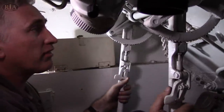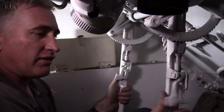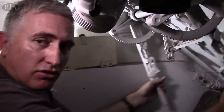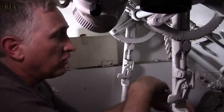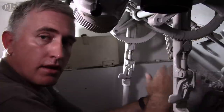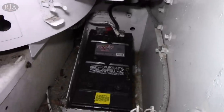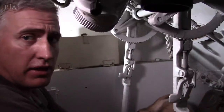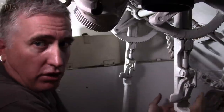The control handles, of course, come down from the ceiling. These are also your parking brakes — so if I pull back to release the tension I can release the latch and the parking brakes are now released. And you are now steering in your normal manner, both to stop, and then you set your parking brake again and you're good to go. There is of course the option of the knockout port just as on the bow gunner's side. Master power is over his left shoulder together with the battery. To his front the dash is simple and laid out — this looks a lot like what we saw on the M24 and the M37: two rev counters, two ignitions, two starters, two oil pressures — two of everything, because you've got two of everything.